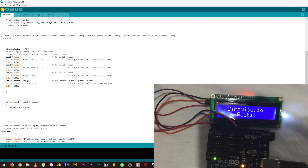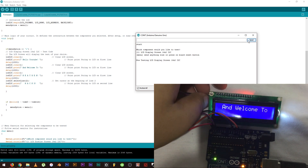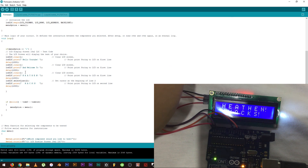After editing the code a little bit, click the check symbol to verify and compile the sketch, then click the right arrow to upload it to our board. Find the serial monitor window again and press 1. It's basically trial and error if you have limited knowledge, but it's okay. You can also edit the time of the delay — 1000 equals 1000 milliseconds or 1 second. When you're happy with the results, it's time to move on and use another module.